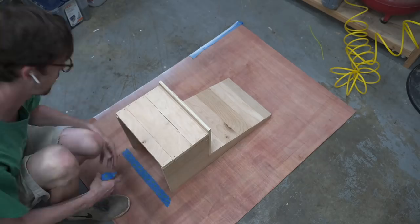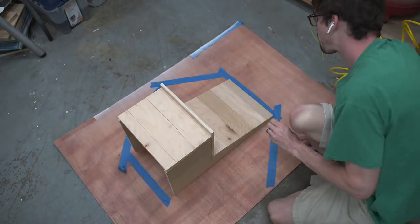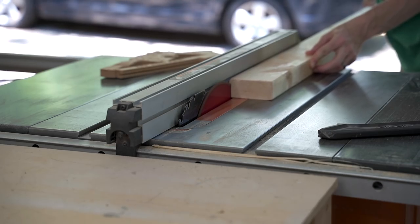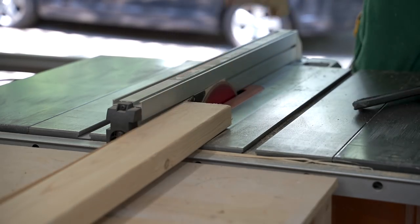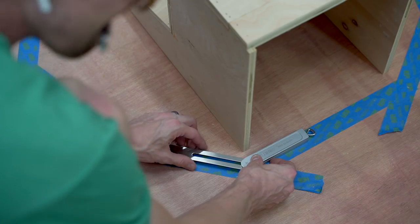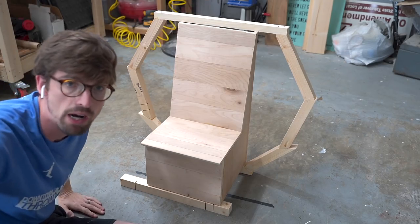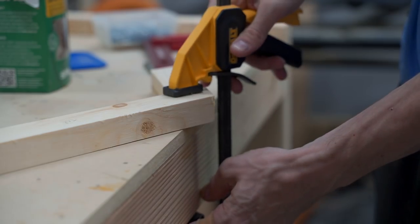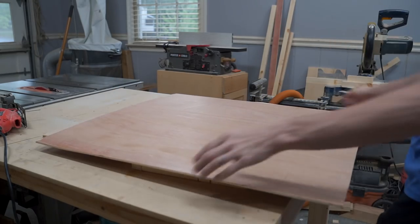Once the seat is put together, we're working on the back frame. I'm cutting out different angles to make a hexagon shape — it's shaped more like an actual X-Wing with a flatter top so I can potentially put an R2-D2 right there in the back. I'm cutting angles and then screwing and gluing them together. Because it's not super strong, I'm backing it with quarter-inch plywood.